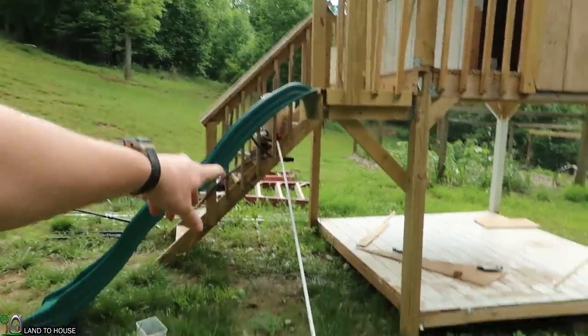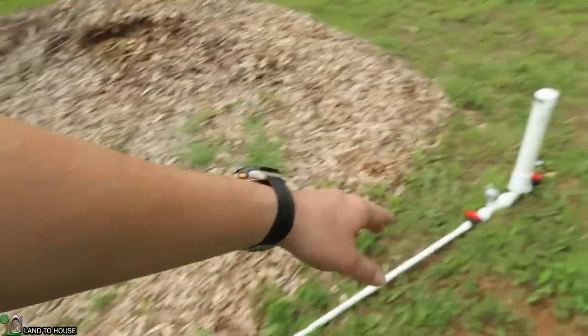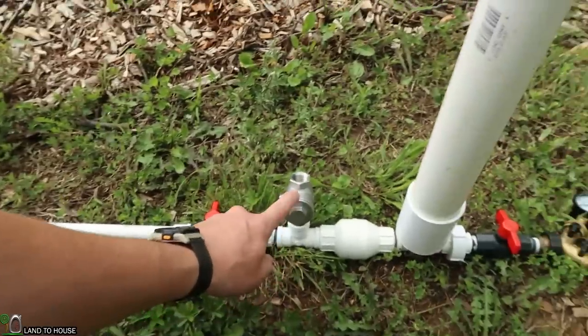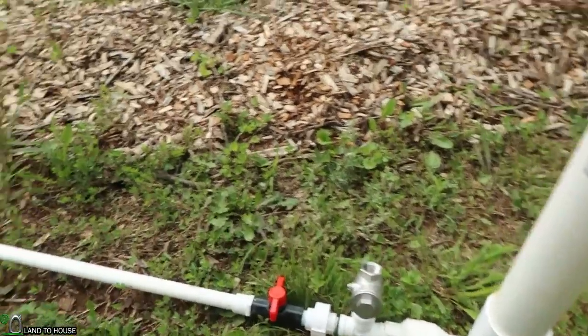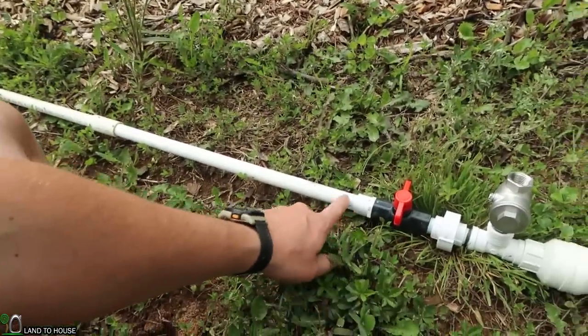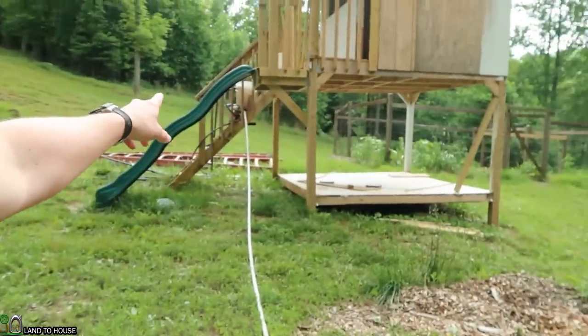Normally you would have your source coming down the creek. In this case you've got a bucket with about three feet of drop that comes straight down to the ram pump, and the drive pipe comes in here — waste valve, inline valve, pressure tank. We want to find out what happens if you put the valve here in the drive pipe. I'm going to test that out and also place it at the bucket to see if that makes a difference. It may stop the pump completely — I just want to see what happens to answer this question.